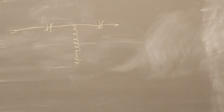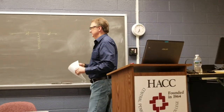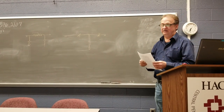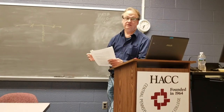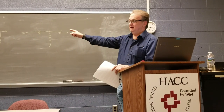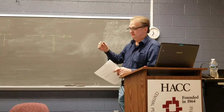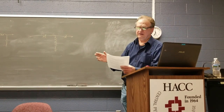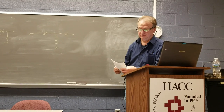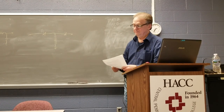So many times at a ham fest, you're going to pick up a tuner. I would recommend opening it up before you buy it, because you're going to find a lot of times people don't regard that. If they have a tuner that's rated for 500 watts, and they're running a 500 or 600 watt linear, then that's pretty cool, because I can tune this to no SWR back here at the transmitter, and it's going to work out there. But that power is being absorbed inside this unit, and you're going to find burned pieces in there. You're going to find some arcing, and over time it happens to a lot of them. But if you're careful with your antennas and your tuners, you won't have that. The best idea is to get a tuner about two or three times bigger than the most power you're going to put into it, so you can avoid some of that. That's the whole idea.